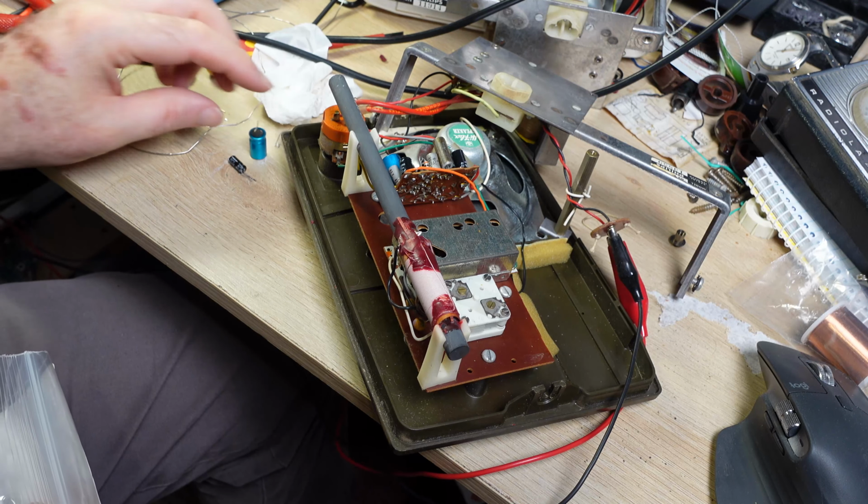Actually, what I'll do is I'll squirt the volume control out. I'll just use this contact cleaner. Turn the power supply off. It's beginning to feel a bit better. So even though these are sealed, well, the case is sealed on them, dust does get in, as you can see around here and on this one over here.